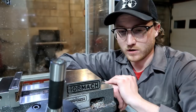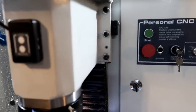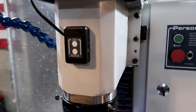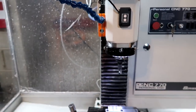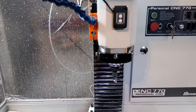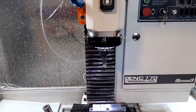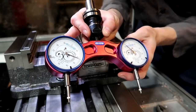After testing everything else, I looked at the spindle head casting. On both sides there are three bolts and the head is doweled. I loosened those up and tapped it to one side with a dead blow hammer to straighten it back out — kept them pretty tight and just tapped. Tormach confirmed that after seeing everything I'd done, that was probably the best way to go about the issue, which gave me reassurance I did the right thing.